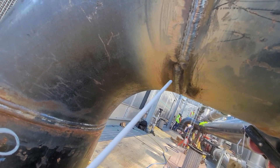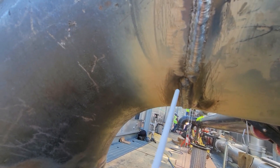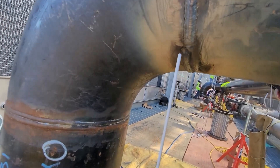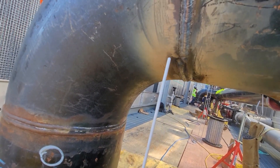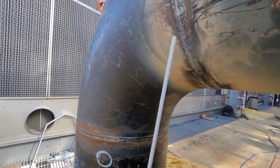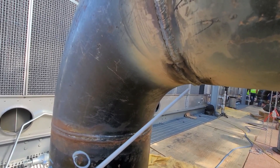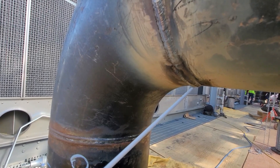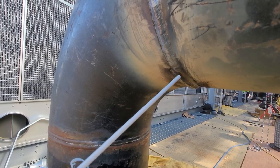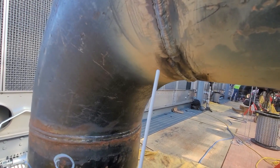Up, up, up until you get about right here. Then you stop, change the position, and go up. Keep the rod at an angle and go up — continuing upward. You're gonna go from here doing an upside-down C, going up. It's kind of counterintuitive, but this is how you do it. This is how you make a pretty bead at the bottom, coming all the way up. Then when you get to a certain angle, you gotta stop, restart, and start going up again.